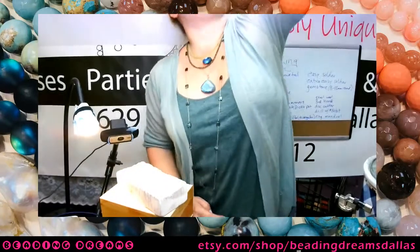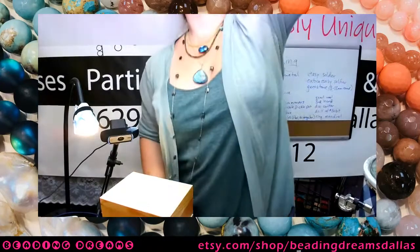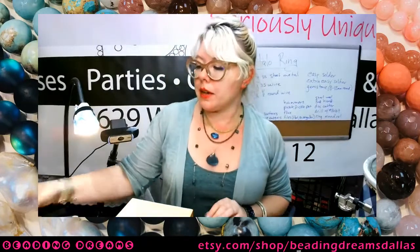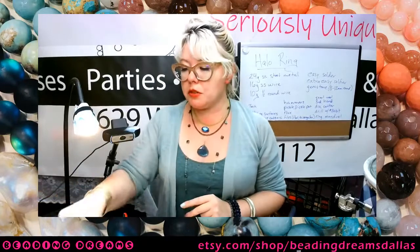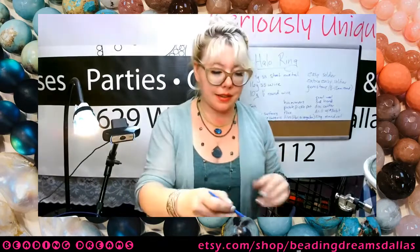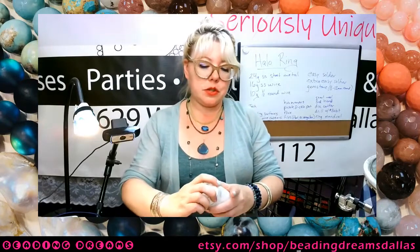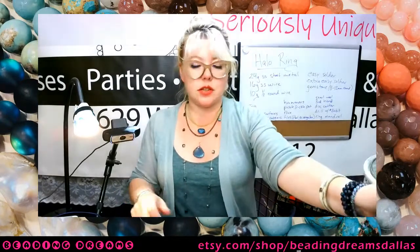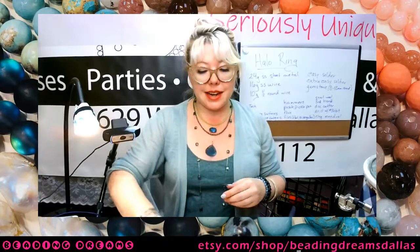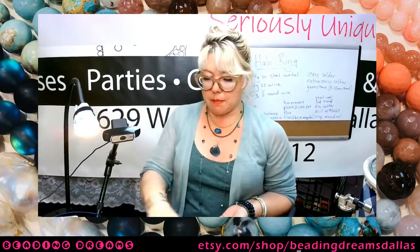So pickle is a weak acid solution. And what it does is it cleans all of the gunk, all the flux residue, all of the oxides, all of the kind of gross stuff off of your metal so that you can do one of two things. You can use pickle as a way to clean in between soldering passes. So if you're doing a very complicated piece that has multiple joints, you actually can pickle in between each joint or series of joints, just because solder sometimes gets a little bit grouchy about flowing onto oxidized and dirty metal. It doesn't really like it. So you can pickle in between joints to clean your metal up, make it easier to solder on.